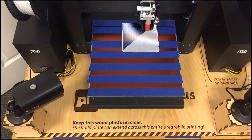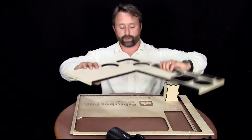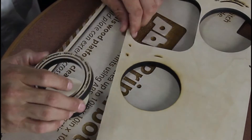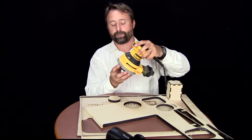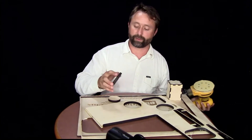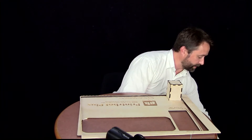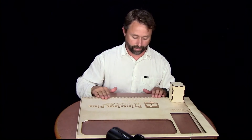One of the things I can share that I learned in this process — something I've done with other projects — is to use your scraps of wood when you're sanding the caramelized, smoky look off the wood after using the laser cutter. Instead of just taking a piece out and sanding it directly, use the scraps as a frame around it. That way you don't accidentally dig into the edges and cut through the veneer, showing the thin edge of the plywood underneath. In this prototype I was rushing it just for form and you can see where I didn't use the scrap frame around this piece.